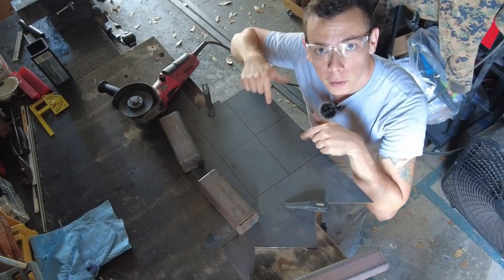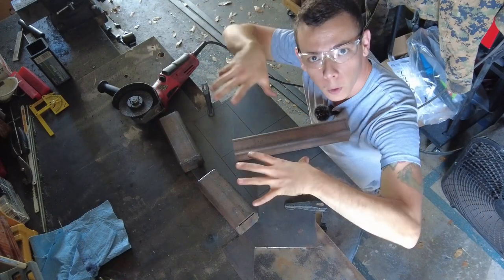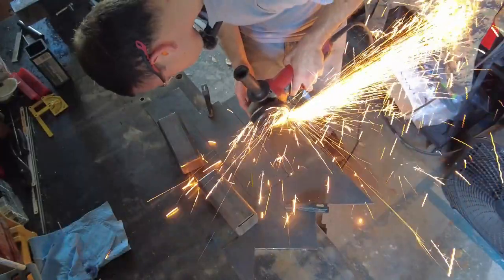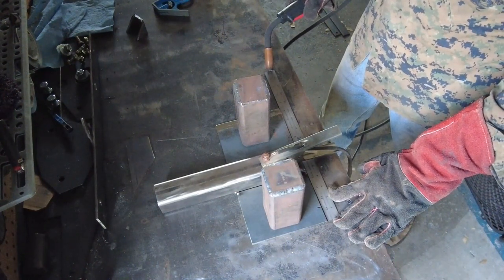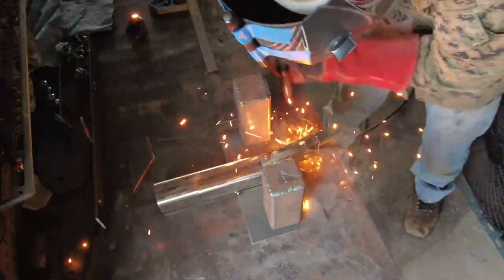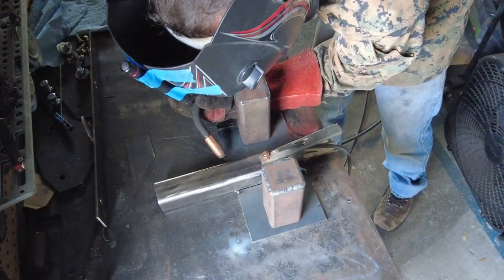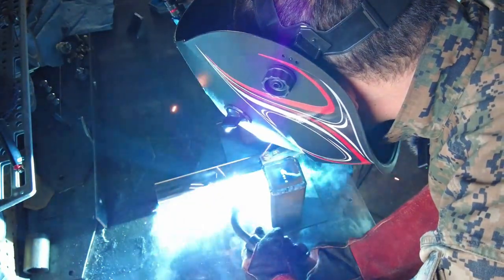At the workbench we're ready to cut out the two plates that are going to mount up on either side of the tube, and then the winch will mount to this plate. Now that I have these three pieces I'm ready to tack them together — this will serve as the beginnings of the remote mount winch plate. You'll notice these big rusty pieces of steel on top — those are what I call gravity clamps: essentially pieces of steel filled with more steel, weighing about five pounds. They're nicer than normal clamps because you just lay a big weight down and your piece is held in place.